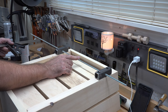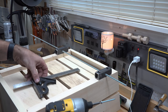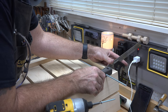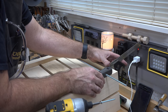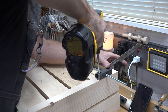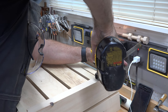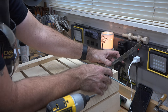With the makeshift brackets in place, I'm using a piece of quarter-inch rod as our axle. I've set my combination square to the measurement I want for the axle. Sometimes you don't get exact measurements on both pieces, which is why I'm measuring from the axle rather than from the steel. Once you get it lined up and you're happy with it, drive it home. Finish the other side and the axle brackets will be in place.